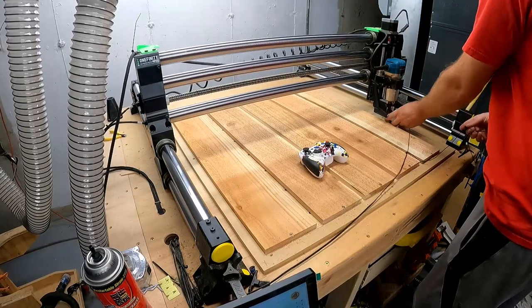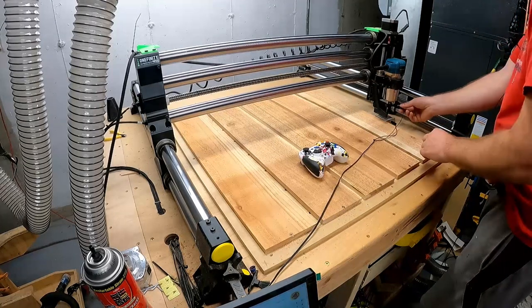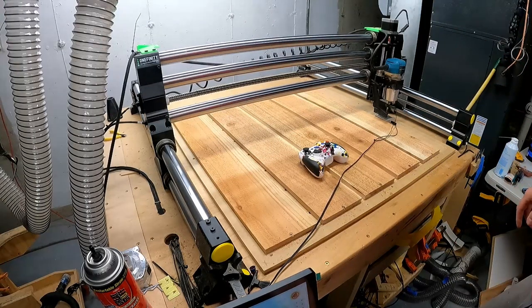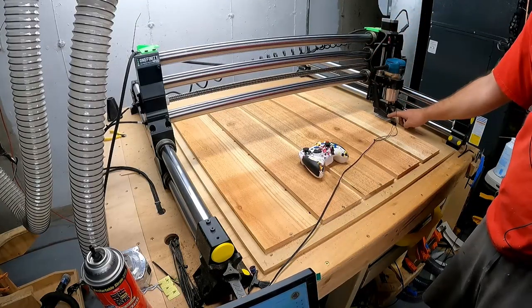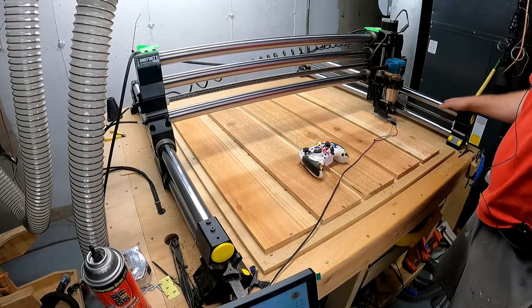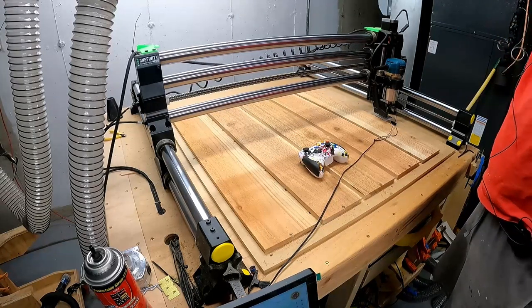Bring them on over. Make sure that's there, there, now going to click the probe Z button. So whenever you click the probe Z button, do not have this bit too high. If you have it too high, it'll throw up a big old error on you. It'll lose everything, it loses its mind.